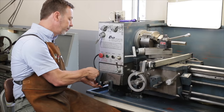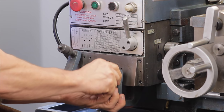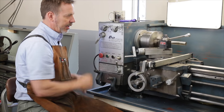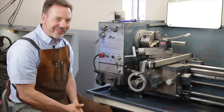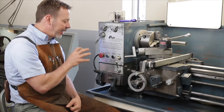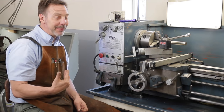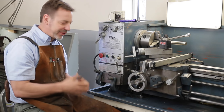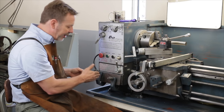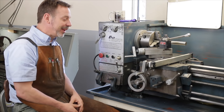You want to run it through every possible combination available — all eight of these gears and all five of these gears — to make sure you're not hearing any clicking or grinding. Clicking means there's probably a bad tooth; grinding means something is out of alignment. Also make sure that these brackets are straight. Sometimes these machines get hit by something or tipped over, and that will show evidence.